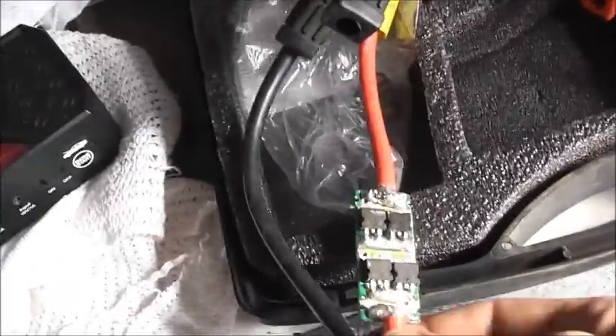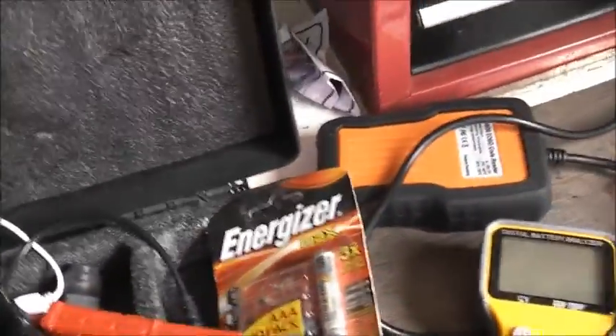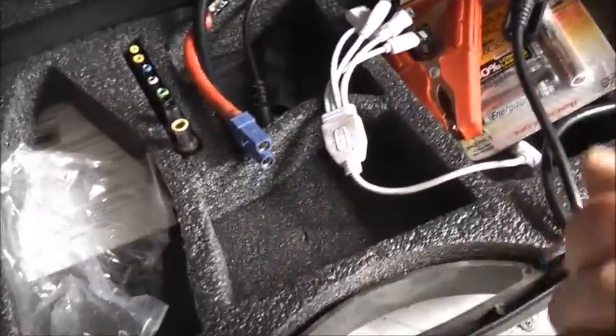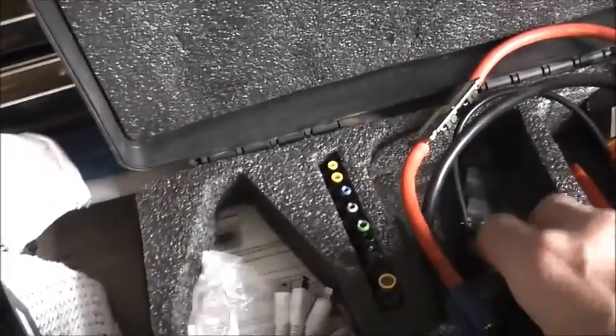It's all nice and fixed for now — we'll see it's fine until I get my parts. I've also bought a nice big 8x 18650 battery caddy slash power bank and charger kit, which I'm going to use to put my laptop cells to use. I can also use the two cells from my flashlight in that bank as a reliable charger for those flashlight batteries. The inbuilt charger in that light burnt out when it was new. This universal power bank kit will have those two batteries plus six laptop cells, and I get a USB power bank out of it — a heavy duty, powerful one. Makes good use of all the laptop batteries.